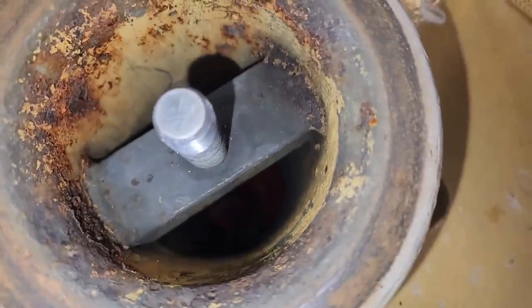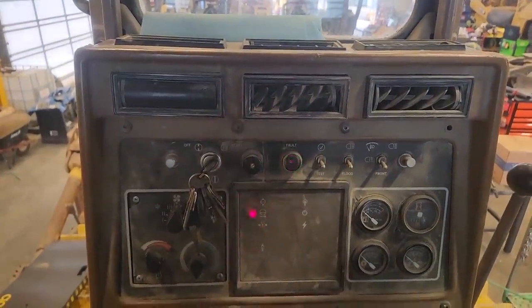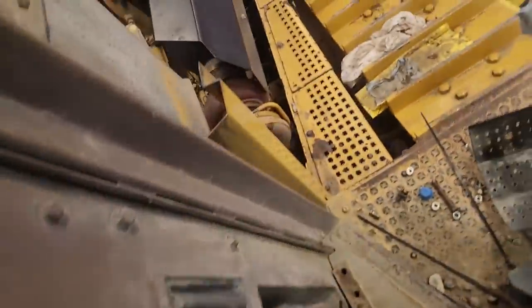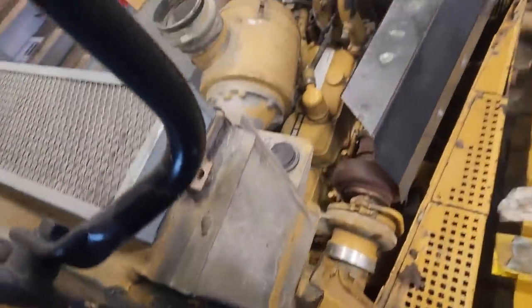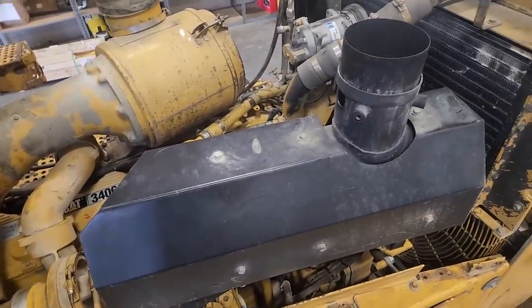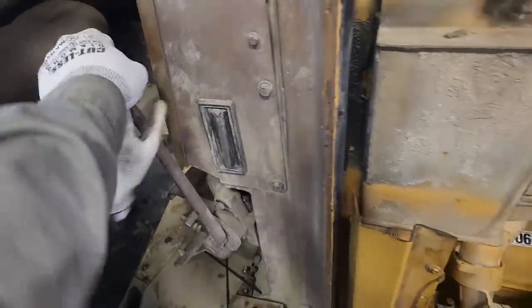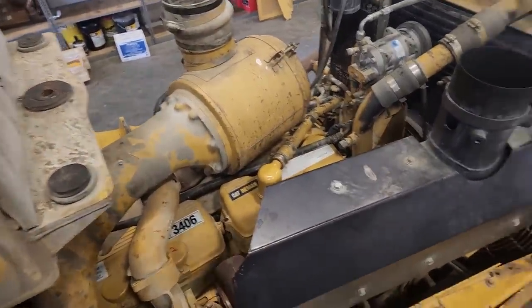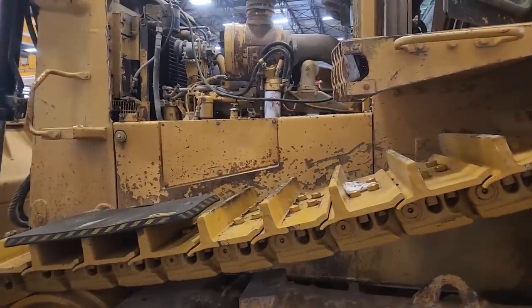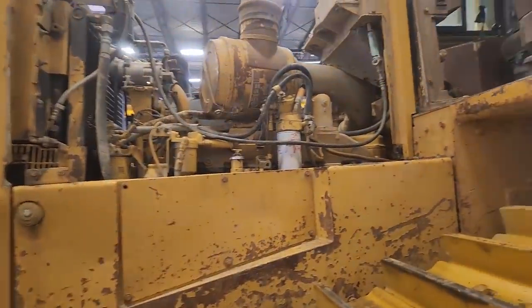What the heck is going on here? I have never seen a radiator cap like that — I've worked on much larger cooling systems too, like 3500 series, and never seen that. It did fire right up, and this buzzer was going off which I had no idea what the warning was. We had to look it up — it's actually a coolant flow sensor, which I've never heard of before. Basically it's like a flapper valve: when coolant is pushing against it, it's a switch that tells you if coolant is flowing or not. We checked it out, coolant level is fine. There is no sound quality that will give you the feeling of sitting right next to that exhaust — it moves you, it shakes you being that close, and that exhaust system is really short so it doesn't muffle that well. It is a little smoky, but it is an older 3406 so that's not too surprising — it smoked like that before. Can't say if that has anything to do with the oil consumption problem — we'll have to wait and find out.